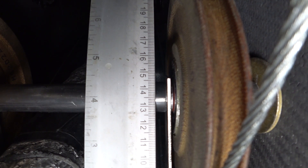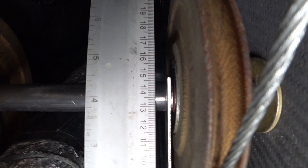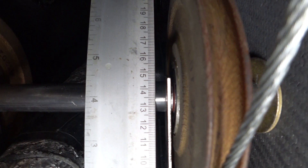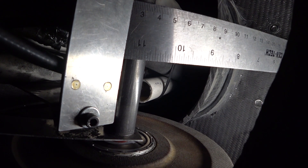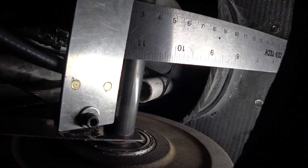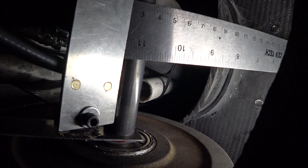Welcome back. In order to see exactly where my remaining movement is in the system, I've got some close-up video with a ruler next to the cross rod and the front pulleys in the keel. I'm getting about a millimeter of movement in that one. I put that into CAD and a millimeter of movement on both ends translates to about one-tenth of an inch of play in the cable. The back one has even less. I can probably pull most of that out just by increasing the pretension on the cables.